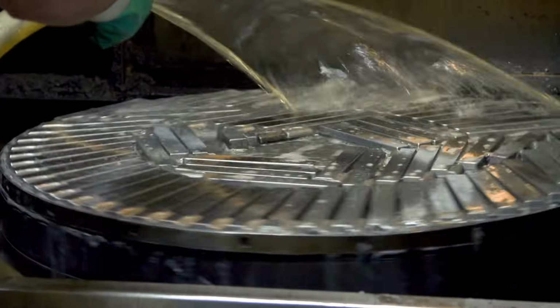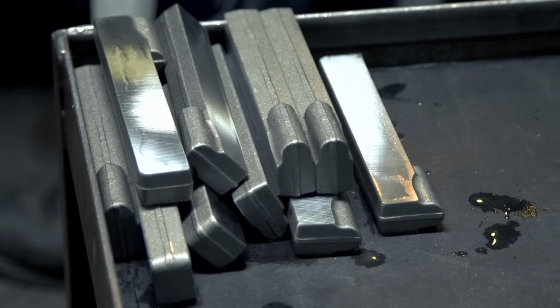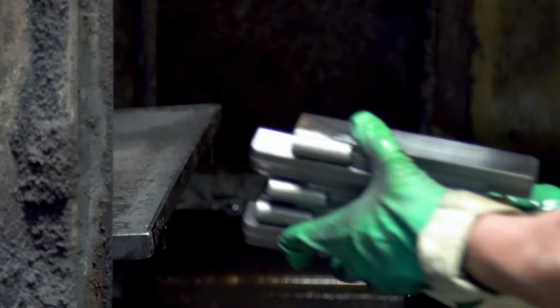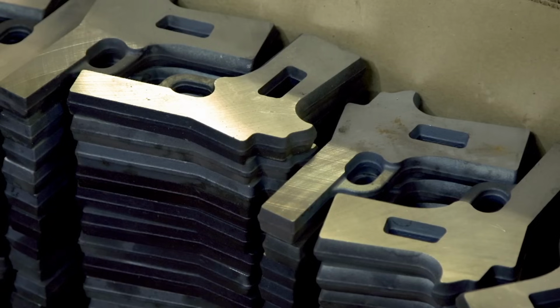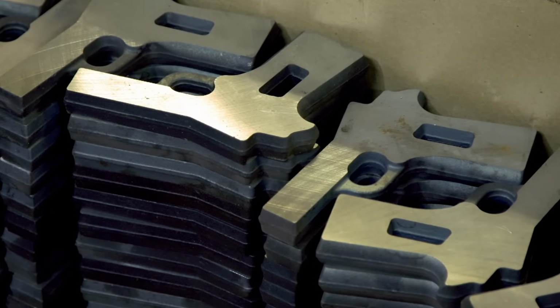They go onto a machine, they get essentially flattened to two parallel surfaces. Forgings, of course, there's a lot of variation in a forging. And you can't really start machining a forging until you create two surfaces that are true. And so that's the first place they all go.